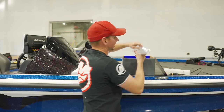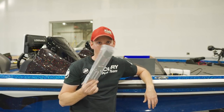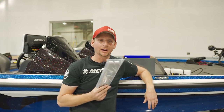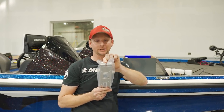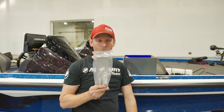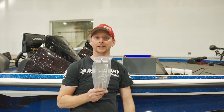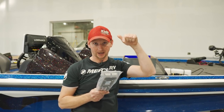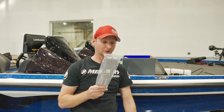Here's a benefit that a lot of guys complained about, myself included. Lowrance is now using all metal brackets on everything they're shipping for 2019 product. The other improvement is they notched right down the middle of the bracket — that didn't used to be there. It used to be a huge hassle running an LSS-2 or TotalScan transducer on this bracket when the cord came out the front. They used to say just run it up the side, but that doesn't look professional. Now you can run the cord straight up the back of the transom, which is much more efficient. Thank you for correcting this so we're not breaking plastic transducer mounts.